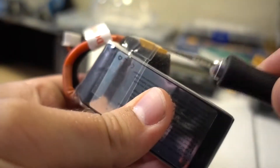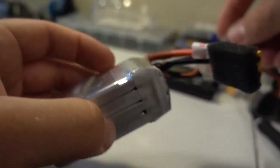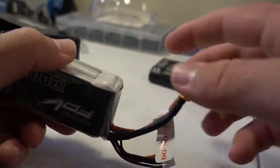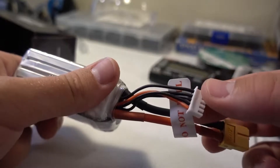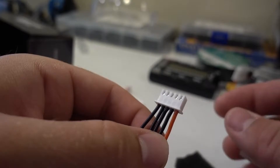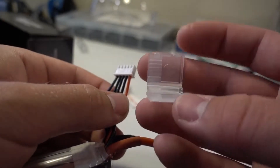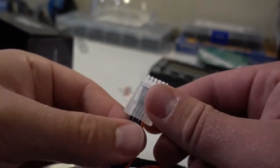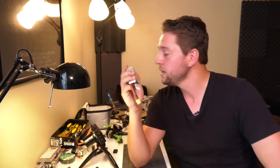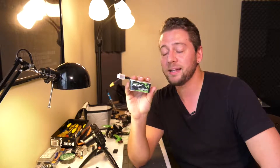Using a little X-Acto knife to cut through and release the cables. There's our XT60 and then our little charging lead right there. I never keep this on my batteries. However, I definitely am going to use this little buckle clip that they give you to attach to the charging plug. Now the C rating is the interesting part about this battery for me. I usually fly 75C batteries. This is 100C, and the C rating basically refers to the current flow that you could potentially achieve with a battery like this.